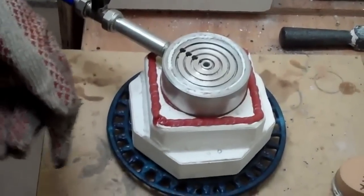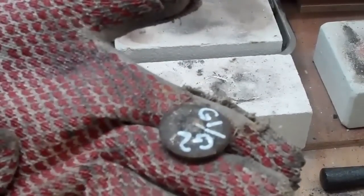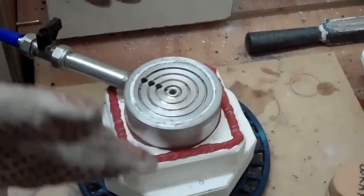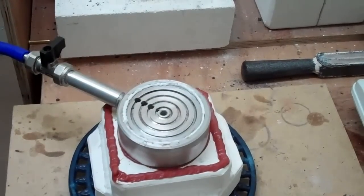This is quite different to the ring shape where we've got a small amount of metal quickly filling the mould and we've got a nice big lump in the sprue there in the bottom to feed it down. If you want all the metal that the crucible can contain in your job you can't have any feeder — and you see there is virtually no feeder at all. To give good filling without any weight on the top we're sucking from the bottom, so we're using vacuum assist, and I've put a silicone bead around there to give us a seal.